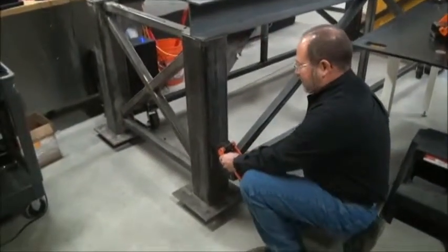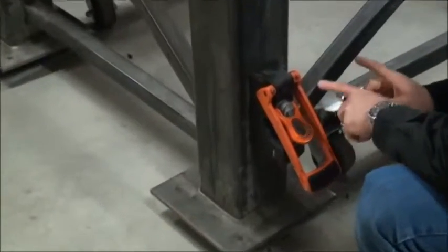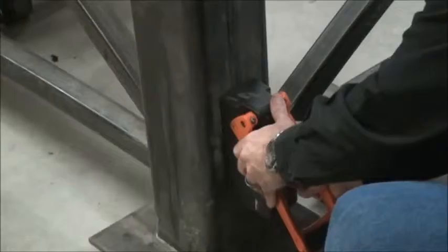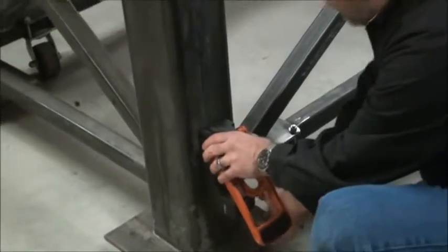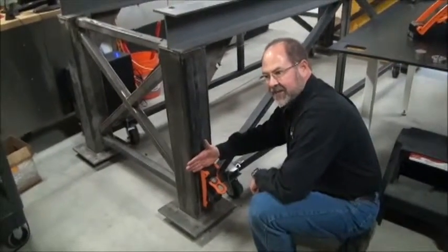When you're using it vertically, this may be supporting a very heavy piece of steel you need to use. It just has enough residual magnetism to hold its own weight — not enough to bother you, not enough to make it tough to take off. Just enough to hold its own weight, get in position, put it exactly where you want it, and simply turn it on to hold heavy pieces of steel.